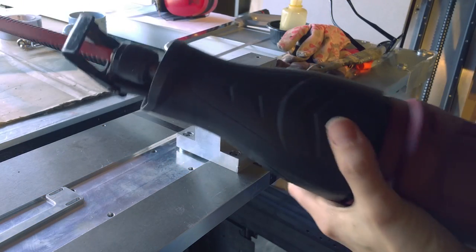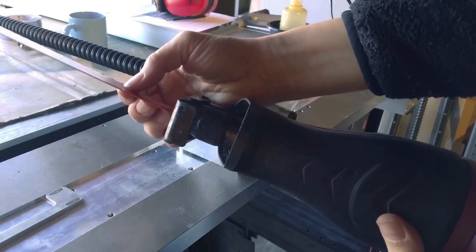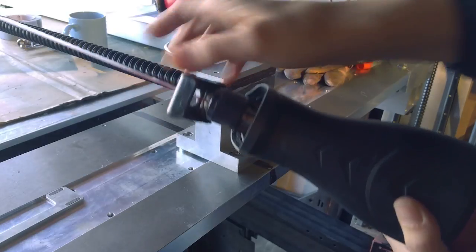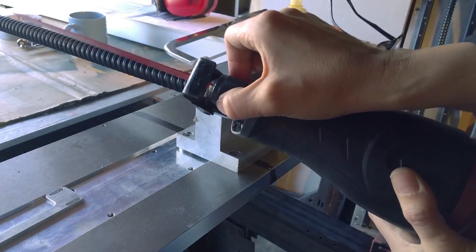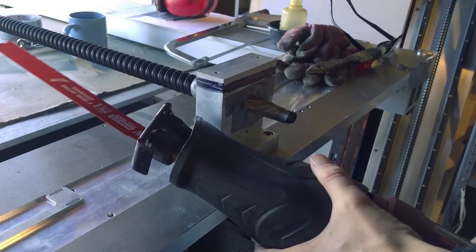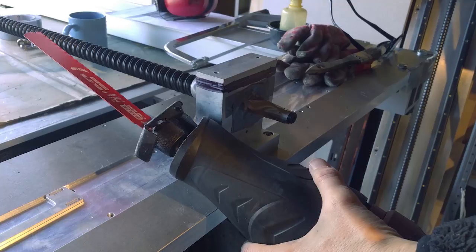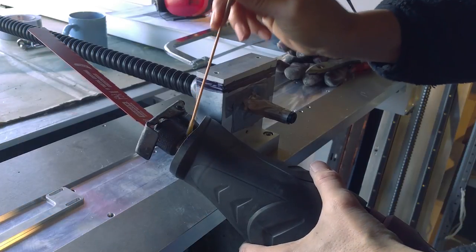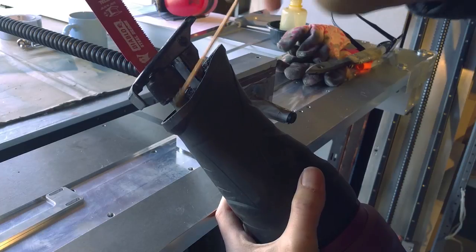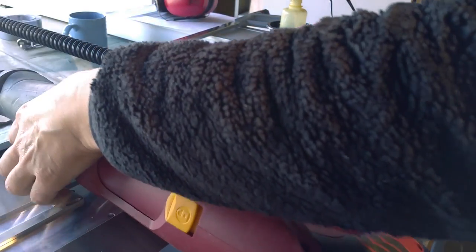I'm going to try this Harbor Freight electric hacksaw. Interesting thing is that this saw, you can hear this. That's not thrust, that's side-to-side play. And I've always kept this thing oiled. The bushings are already bad, and this probably has less than 20 hours of use. I usually put oil right in here to keep the bushings fresh. But I guess that even that wasn't enough.